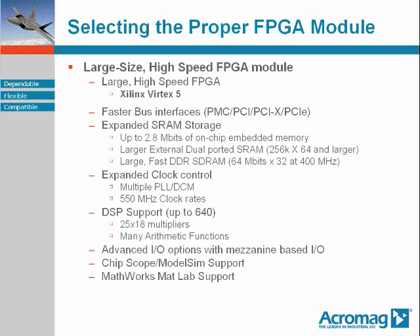Multiple DCMs for clock management, including PLLs, are a must. Clock speeds are supported up to a blazing 550 MHz. Large numbers — up to 640 — of in-fabric multipliers and DSP IP cores are pretty standard. Flexible mezzanine-based I/O enables hardware interface reconfiguration for widely varied application profiles on all the same FPGA module. There is continued support for logic modeling tools such as ChipScope and ModelSim, and DSP modeling tools such as MATLAB.